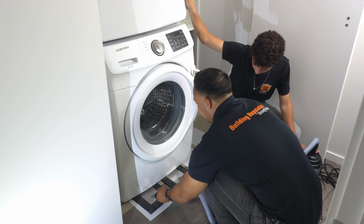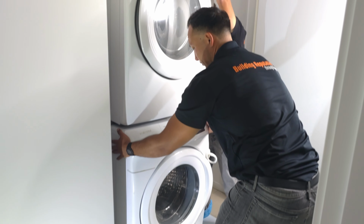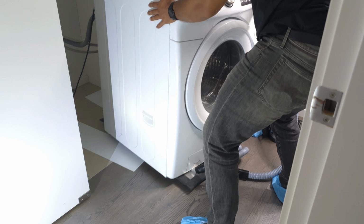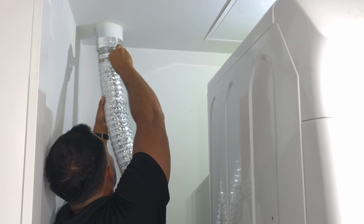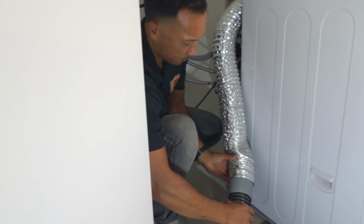When servicing our customers, we begin by accessing the interior dryer vent system. If necessary, our technicians will use an air dolly to safely move the dryer units to gain access to the venting hose. After removing the interior hose, a high-pressure air compressor pushes debris from the ducts to the building's exterior.